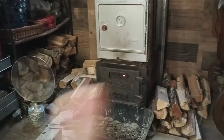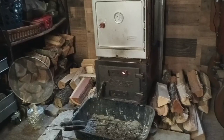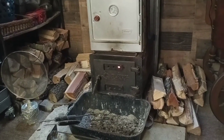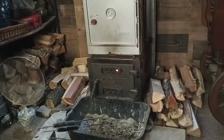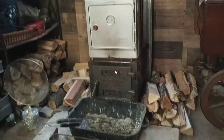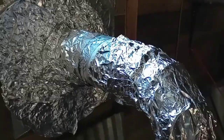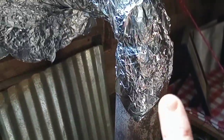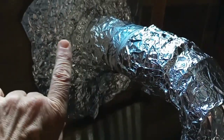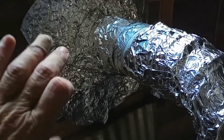The gasket seal — I put it on the inside, and this stuff is way better than what originally came with the stove, so there's a really nice seal. No smoke is coming in. I'm in heaven. Just so some of you alarmists won't freak out — this looks terrible right now but it's not going to stay this way. The foil is going to come off, and there's going to be proper heat-resistant sealing tape. The stovepipe goes up into an elbow and into a double-walled pipe that goes through a double-walled wall thimble.